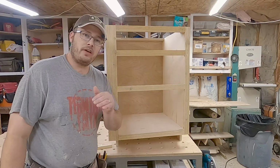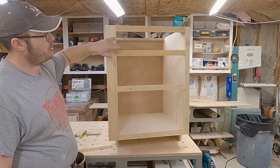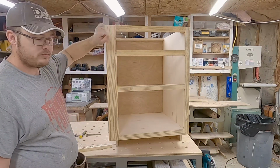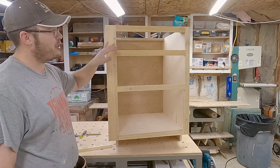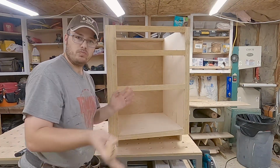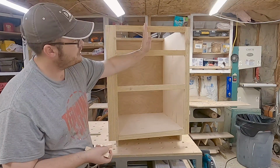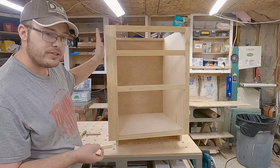Now there are a few standard things for kitchen cabinets that I want to go over with you. Typically, your top drawer in your kitchen, where your forks go, your junk drawers, that's a 5-inch tall opening, and then the width is whatever width it ends up being, whether this is a 12-inch, an 18-inch, a 21-inch, or a 24-inch.